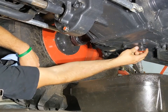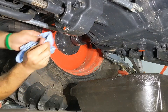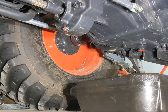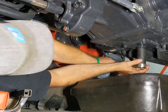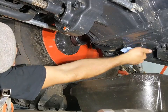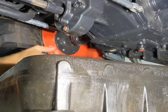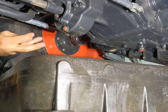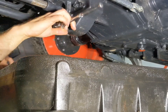Make sure you clean your magnet off too — you'll have a little bit of metal on there, and that's normal. As you shift gears in a non-synchronized transmission, it's apt to grind occasionally. Snug that drain plug back up — it doesn't have to be crazy tight. I'll slide our drain pan forward and we'll do our low spot here for the front driveshaft drain, which is also 14 millimeter.